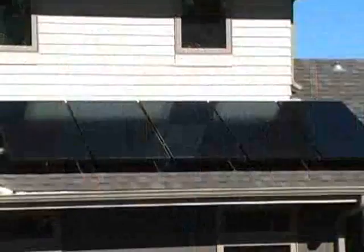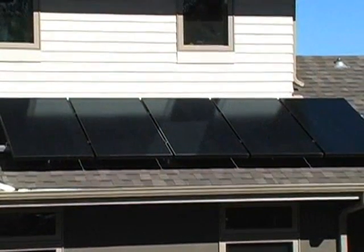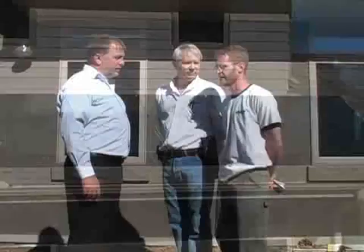This particular system is a 5 kilowatt array. It's made up of 24 215-watt solar PV panels. These are monocrystalline panels and very high efficiency. They produce about 610 kilowatt hours per month here in sunny Boulder, Colorado. That works all the way around the year. We get a lot of sunshine year-round here, nearly 300 days. So PV is a great product for Colorado.